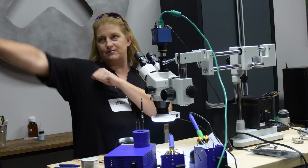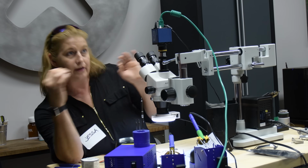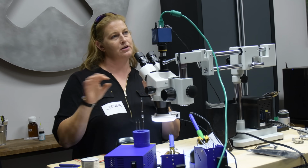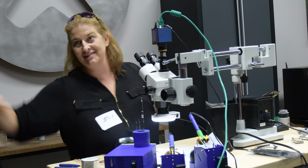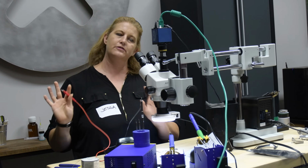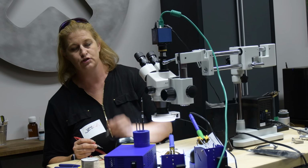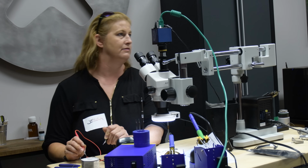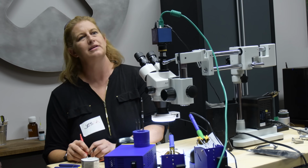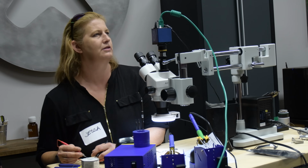Low resistance. Yeah. It's really only going to happen if the wire is really like butter, right? It's going to have to be ice so that a tiny little push is going to make current fly. So just from knowing that, let's make a prediction. On a normal phone, a normal GPU power line, what do you think I'll get if I measure resistance to ground of that line, high or low? Low. I'm going to get low, right? In fact, I might get something that's so low it almost looks like 0, because it's super low. It's just naturally really, really low.